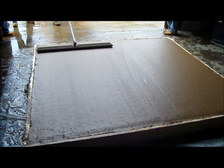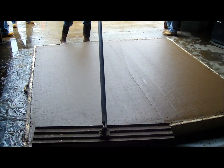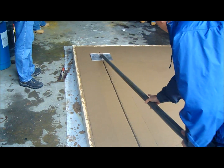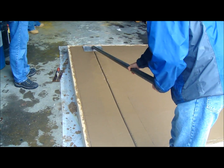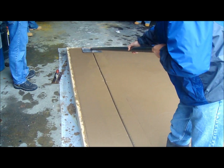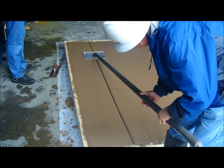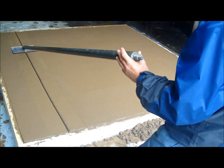Now when you are doing these micro exposures, you got to make sure there's no lines, seams, or anything. So you'll see later on in the video they actually go through with some trowels and get a better surface here. Now on this left side we're going to actually do some stamping and some surface color casting. That's why we're putting in this little joint here. This is basically a hand joiner, good for cutting expansion joints, or in this particular case we're showing how to do a border. Now the color that was used in the center, I believe, was some sort of adobe.